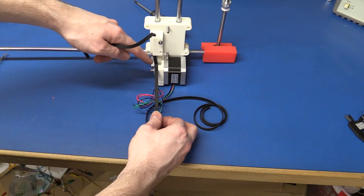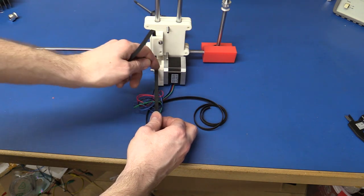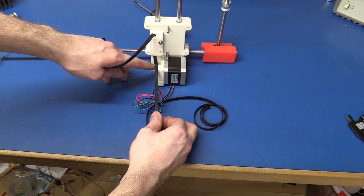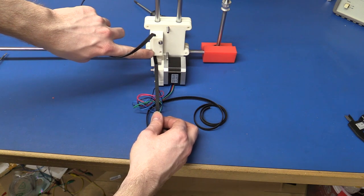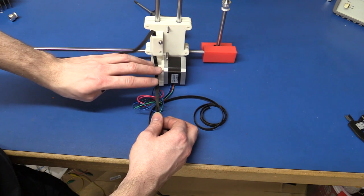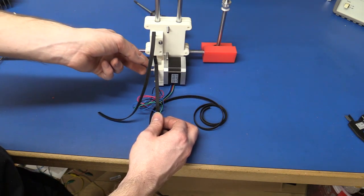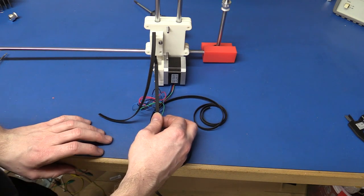And of course I'll have to make sure to line it up with the pulley on the motor here, and also the one in the other end. But that shouldn't really be a problem, because you can see I can easily move the pulley on the shaft here, and I can also move the belt in about 1 or 1.5 millimeter still. So that should be just fine. I won't cut and install the belt just yet, in case there is something I need to change later on. So I'll do that when I install it in the box.